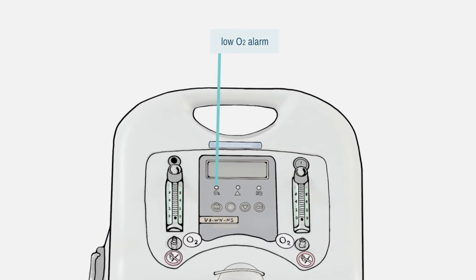On the left is the low oxygen alarm, which goes off if the machine is not producing enough oxygen. There are a number of reasons why oxygen concentration can drop below target levels, which we will explain in later videos in this series. If that happens, it is important to check what is wrong — otherwise the babies on the machine will not be getting enough oxygen.